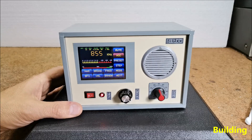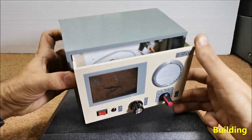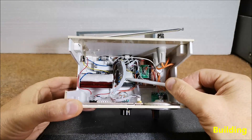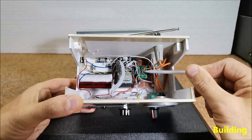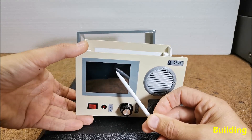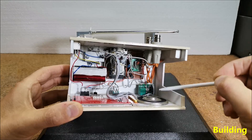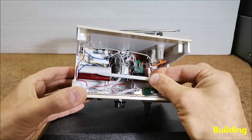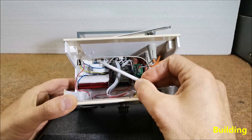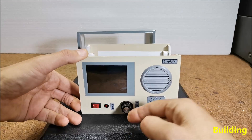The following is a brief description of how this universal DSP radio was made. In short, the radio contains several components: an ESP32 microcontroller board, SI4732 radio chip, 2.8-inch TFT color display with touch screen, small Class-D power amplifier board, speaker, lithium battery 3.7 volt, lithium battery charger board, up-converter board from 3.7 to 5 volts, and a rotary encoder and potentiometer.